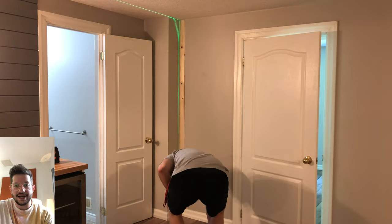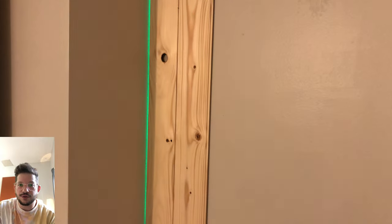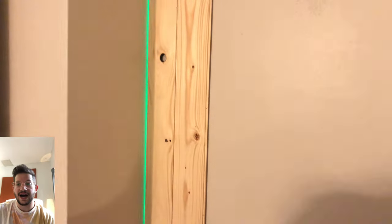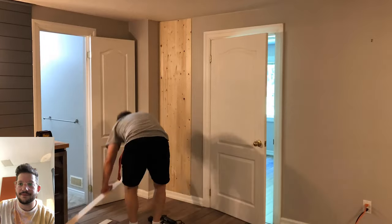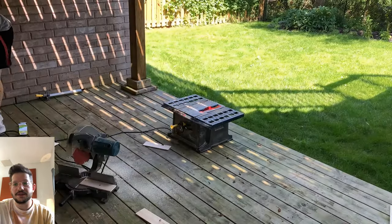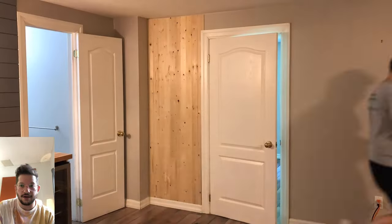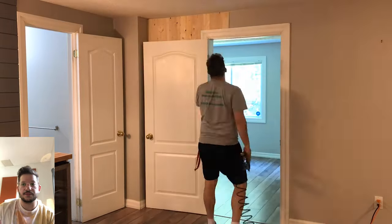I am tacking these in with my 18-gauge brad nailer. Here's a close-up — you can see that tongue and groove slides right in, and I am doing my brad nail right in that tongue area in the corner so that as the next plank slides in, it hides the nail holes. That keeps everything looking nice, professional, and clean. I'm using my laser level every few boards just to make sure I'm still nice and level as we go around the room. I'm using my table saw to make notches to work around the door casing, window casing, and all of the electrical outlets — anywhere we need to work around to get this wood cladding looking clean.